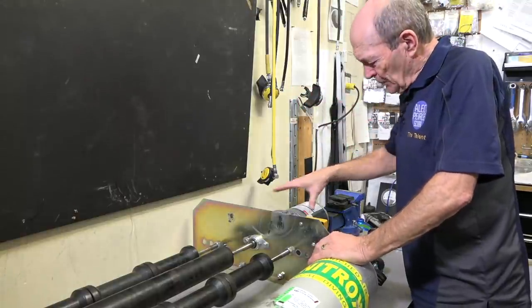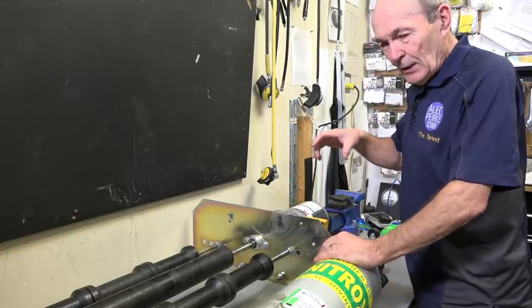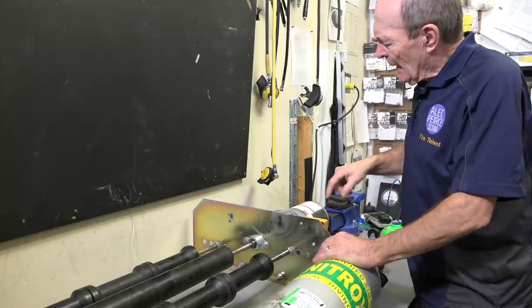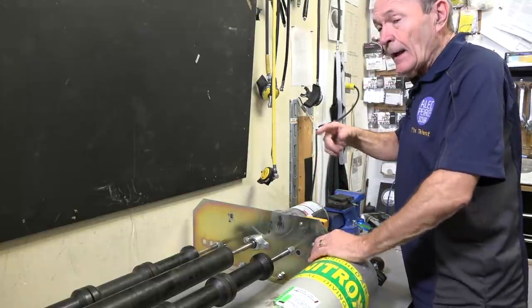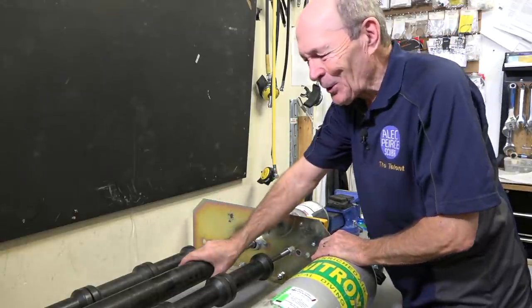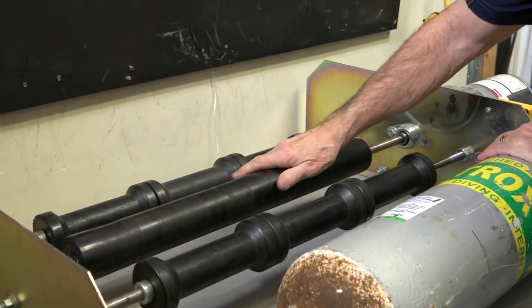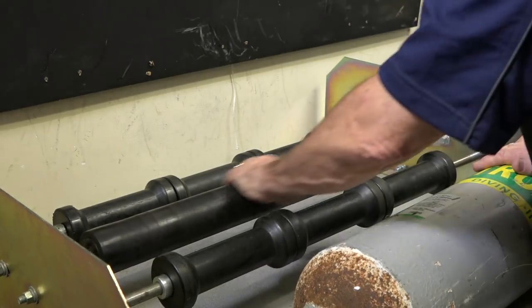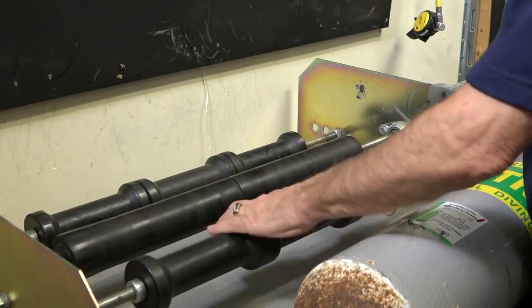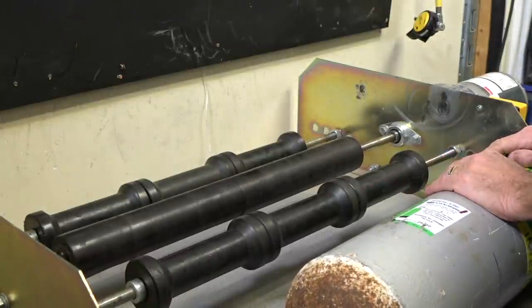There are two ways to do that. The expensive way is with a really nice speed reducer - it's a couple of gears in here. So the motor is connected to a large gear, and then a small gear, and then there's another larger gear that connects to this rod. So the motor spins quickly, but the larger gear goes slowly, so this rod turns very slowly. So the motor spins very quickly, but this is turning quite slowly. And the rubber roller on here can be made of anything as well. So we have a free-spinning rubbery roller on a rod and a driven rubber roller on a rod, driven by a motor.